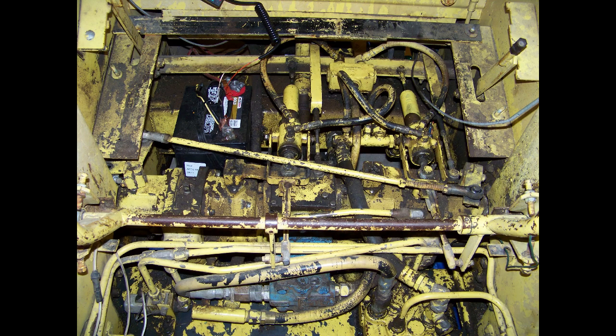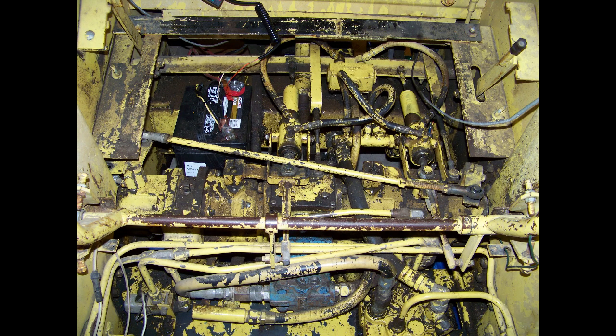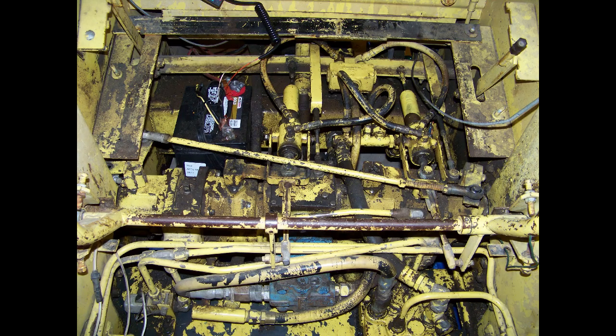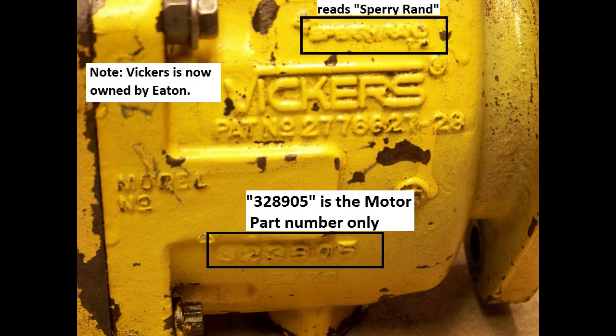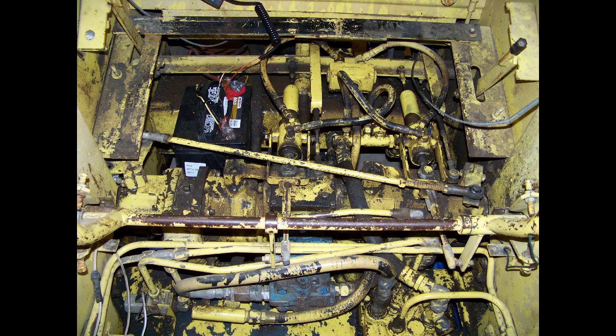The last three parts to know are the control valve, the front manifold, and the rear manifold. To verify that you have Vickers transmissions: if your setup looks exactly like this, you probably have Vickers transmissions. The Cessna transmissions have the steering cylinders in a slightly different configuration and location. To be sure, use your camera to record the transmission housing in this area — you should see an impression that says Vickers. It's probably covered with dirt and concrete, but it's worth verifying.